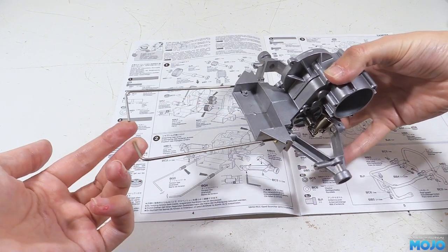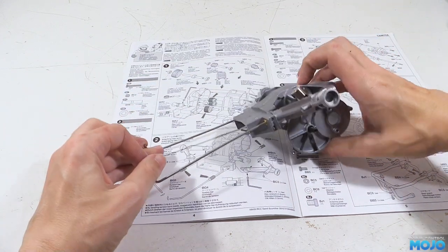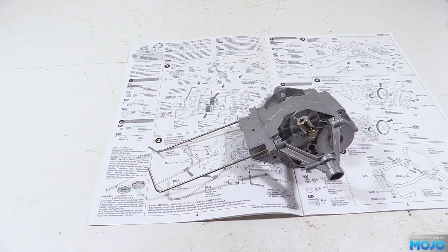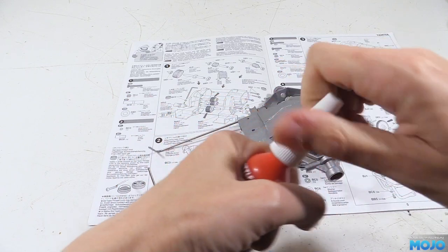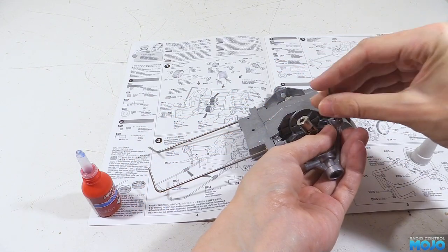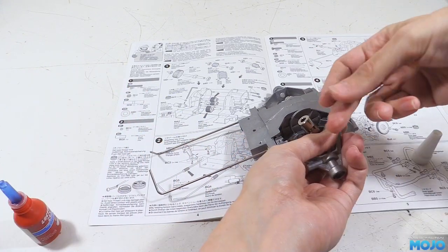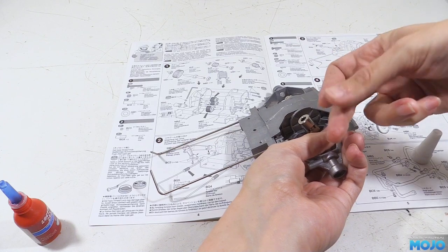The other arm and bar go in exactly the same way, and I think it looks rather good — lots of nice metal bits. Next we pop the grubs out one by one and add some threadlock. We need to make sure all the pins are in just the right spot and the front ends of the bars can sit in their slots. Nip up the grubs fairly tight and we're done with step two.